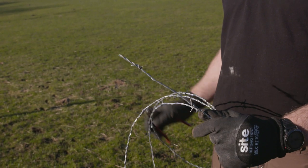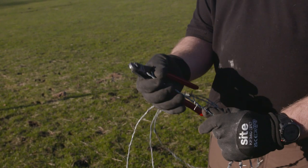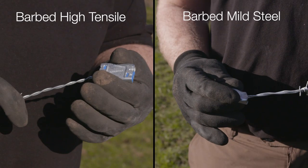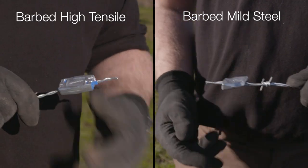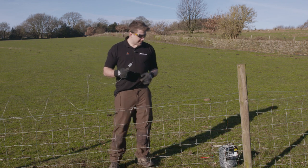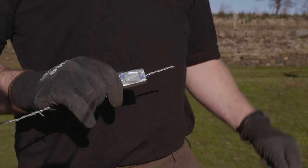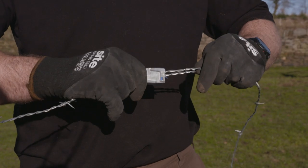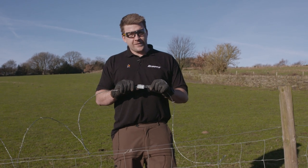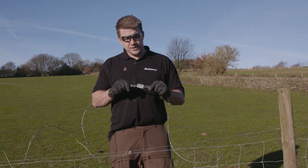So we've reached the end of our roll and now we're going to snip off the final barb, leaving around 80mm of wire for entry into the barbed wire joiner. We've installed the first line; the second line is going to go in exactly the same, and there's an audible click you can hear when the wire is inserted. The Gripple high tensile barbed wire joiner features a corrosion resistant ceramic wedge designed to last the lifetime of your fence.